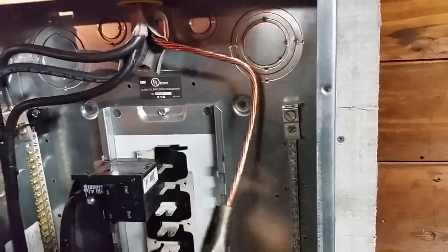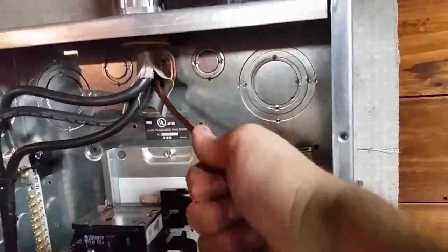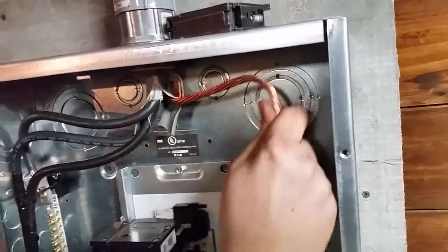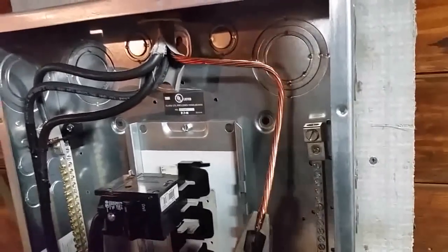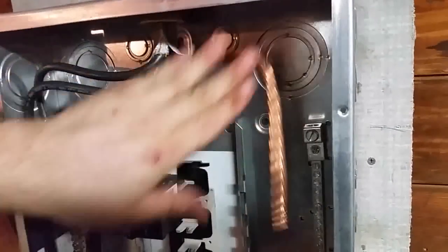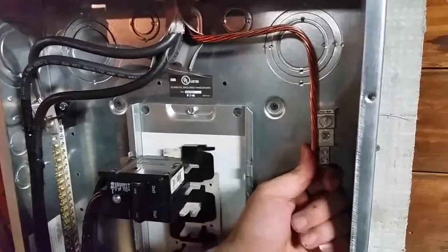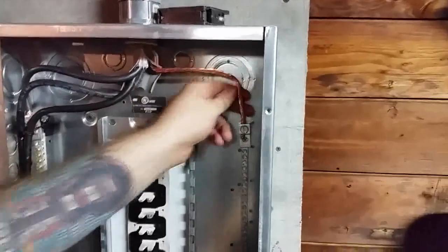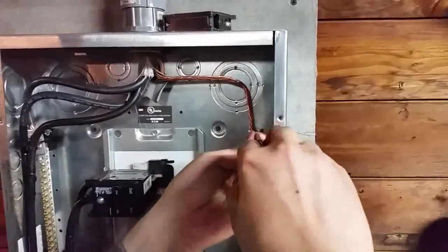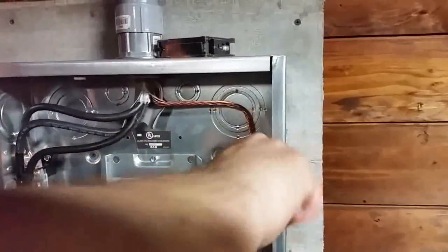And we put a lug at the end. And now we're twisting the ground cable. You don't twist it too much, just enough, because if you're bending it, sometimes it loosens it and it just does single strands. So you just give it a few twists, not too crazy. And that's it. You form it to what you want and pop it in there. Now I've got to cut a little bit and that's it. Now it goes right into the slot. Now it's formed. Put it in, tie it down. Yeah, we're good with that. Now you're good with the ground, the power, and the neutral.